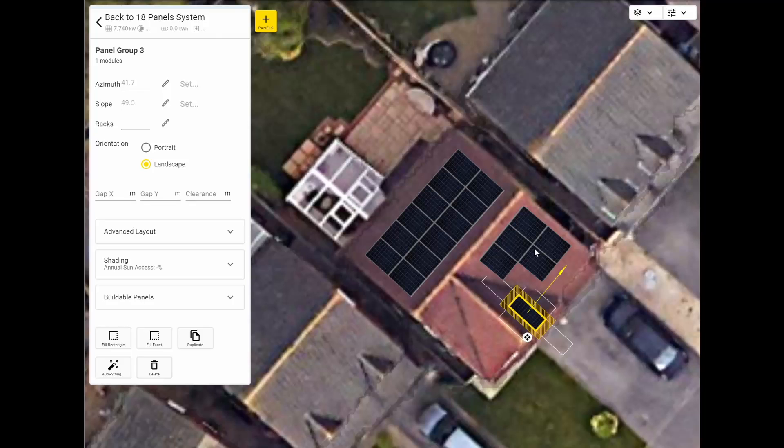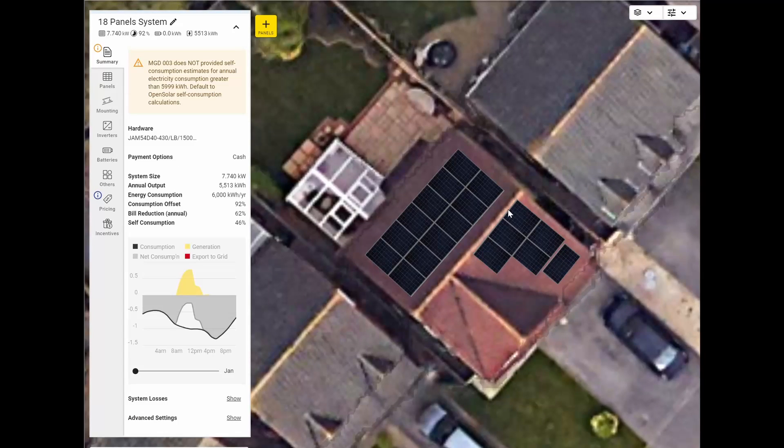Let's see if we shuffle this a bit closer to the ridge. This application will just give you a rough idea because it won't account for any of the margins you need to leave — normally 400mm is recommended for the edges. If that's pushed up to the ridge it may be a bit tight, but it looks like there's potentially room for six panels there. It's hard to see where the roof ends, but it does have a step down and a second roof, so this part doesn't come all the way out to the front of the gable. Six may work on there, with one landscape and five in portrait.